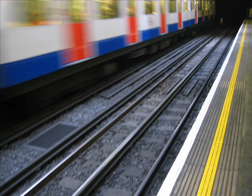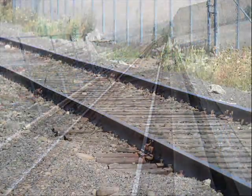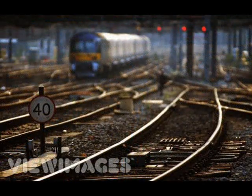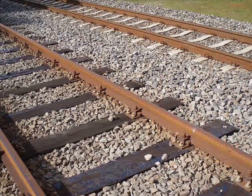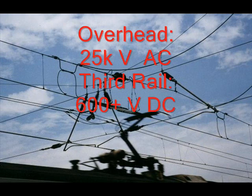On rail systems like the London Underground, there is a third and a fourth rail to close the circuit. Many would ask: isn't it easier to just use the two existing rails to transmit electricity? Well, this method is used in many modern trains but does not function well for large trains, as the sleepers — the rectangular objects used as a base for railway tracks — are not good insulators. Compared to overhead lines, which can sometimes hold voltages of up to 25kV by alternating current, the third rail is charged to a relatively low 600 plus volts by direct current.